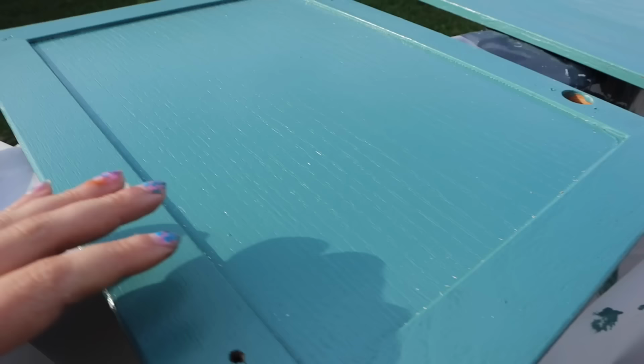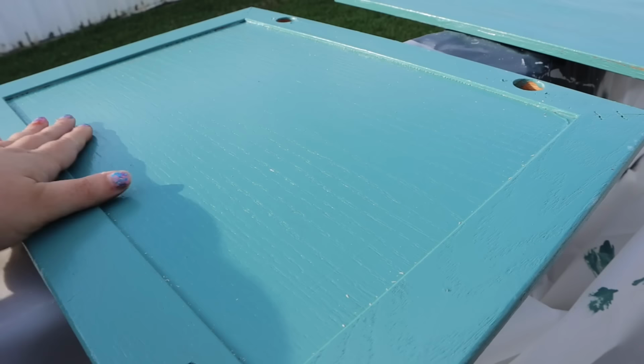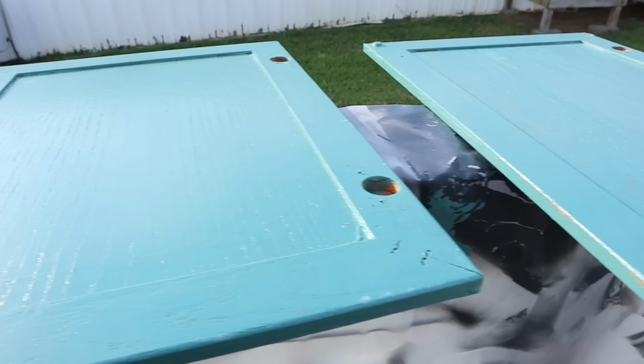winging it. Also, the good thing about stain, any color stain, is it's buildable, so the more you put on it, the darker, or the less, the lighter. So we're gonna go with a really light coat at first, and then if we need to, build on it. Before we do that though, this is what that flat coat of polycrylic looks like on these. It's not shiny, but it's shiny enough that you can tell that it's finished.